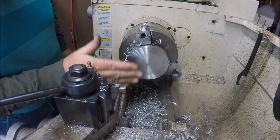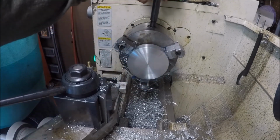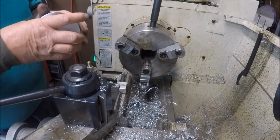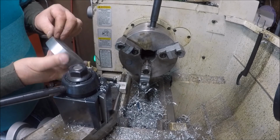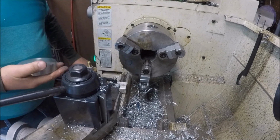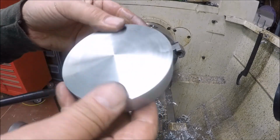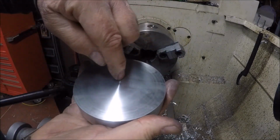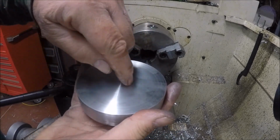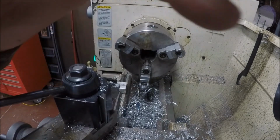We've got two nice, very slick, parallel finishes. Now, if we've done our job with the other, there's no scarring on it. Alright, so now I have a really slick and pretty finish. Now, what's basically going to happen is the mount's going to be somewhere in here, the hole for the other. Then we're going to remove the rest of it on the mill.